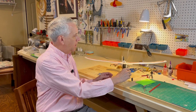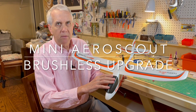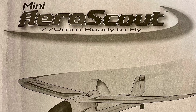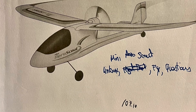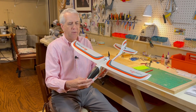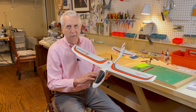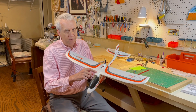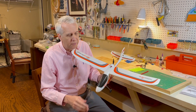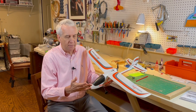This video will be in three parts, covering my journey with the Mini AeroScout. This is a $100 ready-to-fly kit. It comes with a transmitter and everything installed. I'll show you in this video how I just didn't have enough control authority - the control surfaces just did not move enough. I could sometimes control it, but just couldn't get it back to the landing field every time. So I decided to take out the existing control electronics, put in servos and receiver, and a brushed electronic speed control to keep the existing brushed motor. It worked fine - that's chapter two of three. And this is chapter three.